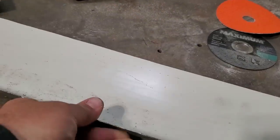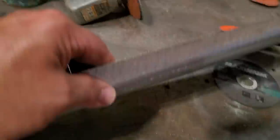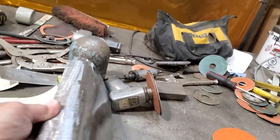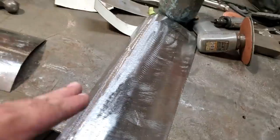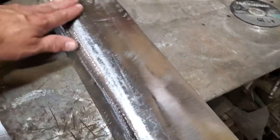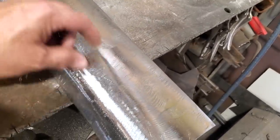I ended up having to hammer down into this section here, onto the bench here, and stretch this area in here, because I didn't like the way this was looking down along here, okay? You can see there's a small crown out there now, but I found this was too flat on the roll. Up here was good, but on the roll, when you look down, the car kind of had this thing going on, so I played around with it, dollied it up, and then basically stretched this area in here, where I just hit it with a hammer on a flat surface.